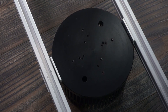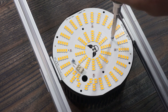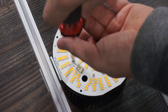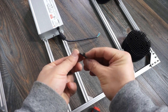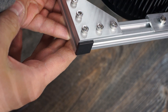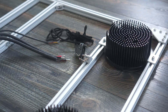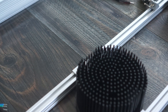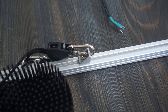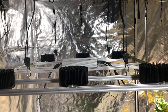The light was now ready for the Logic pucks to be installed. The easiest way to line up the pucks with the heat sinks is to align the pass-through holes on both devices — if you do that, all your mounting point screws will line up too. I attached the pucks using M3 screws, tightening them down in a cross pattern. You can also buy plastic end caps for 2020 to clean up the ends of the rails — I splurged the extra dollar for four of them. Finally, I bolted four corner brackets on top to give me something to attach the ratcheting rope hangers to. The finished light comes in somewhere around 25 to 30 pounds. If you have any questions, leave them below — in the next video we'll wire this up and run some tests, so stay tuned and subscribe.